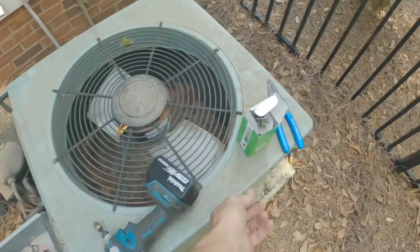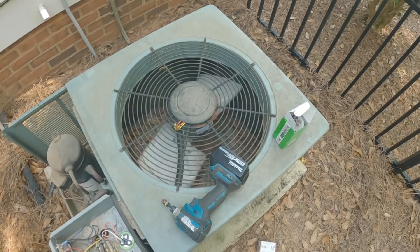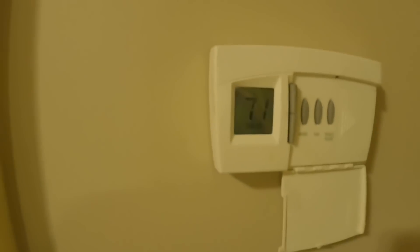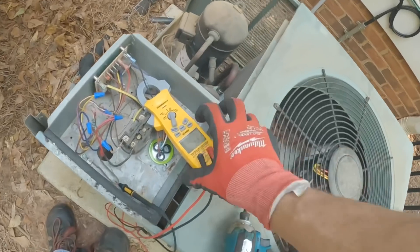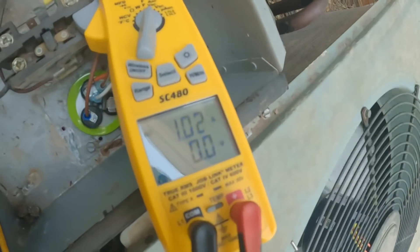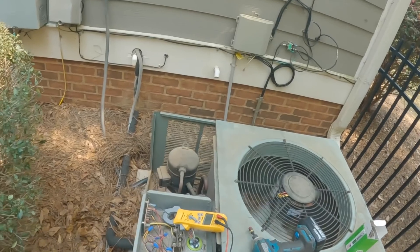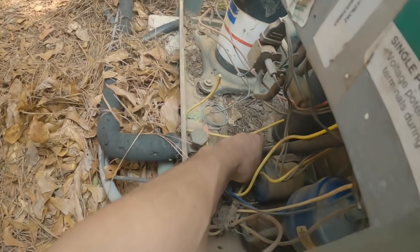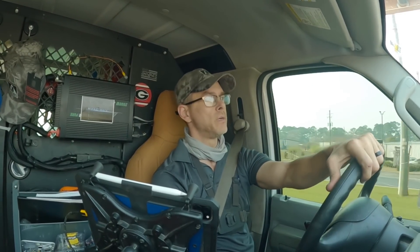Let's just check rotation. Proper rotation — now let's turn it on. I think I have it on cool. This is rated at 1.5 amps — reading 1.03. This is a house that has three air conditioners. That's as cold as it can be. That one turned out nice. I was afraid it was going to be low on Freon, but it wasn't.